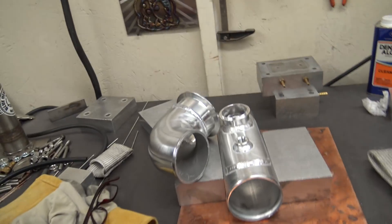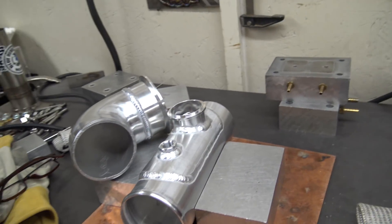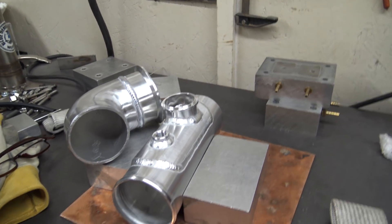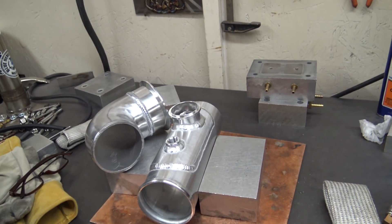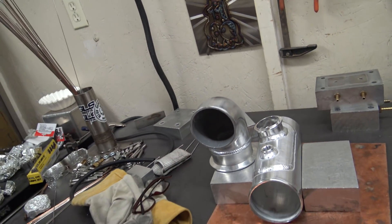That's how I do it, and I hope you guys enjoyed seeing how I kind of skinned that cat. Remember, friends don't let friends weld cast aluminum. Here's the two pieces — it's okay, it's not the best thing I've ever done. I'm not a big aluminum guy, but we got that blowoff valve on there hot and thick, so I think we're doing pretty good. I don't have to worry about it falling off. The cast piece — I think we rolled it on pretty lightly and didn't get much heat into it, so hopefully that V-band is nice and flat.